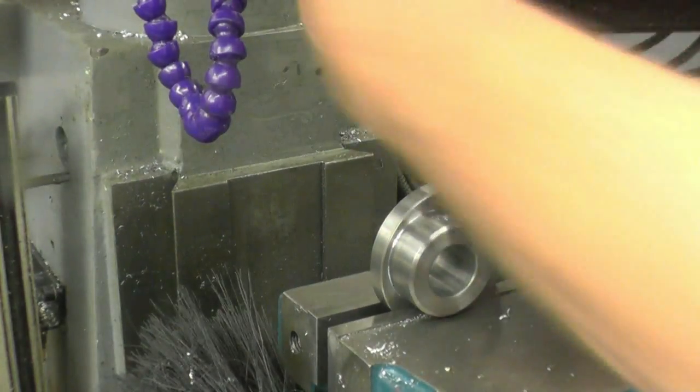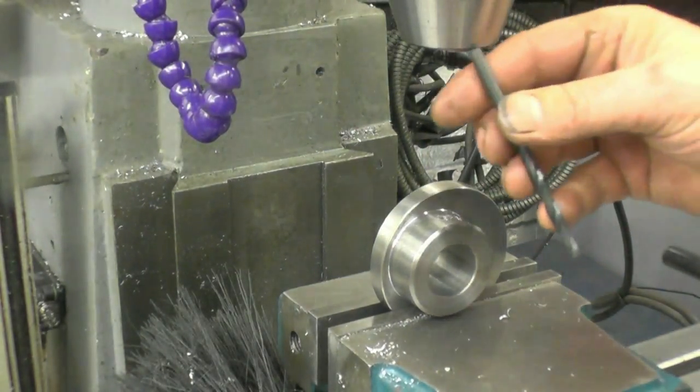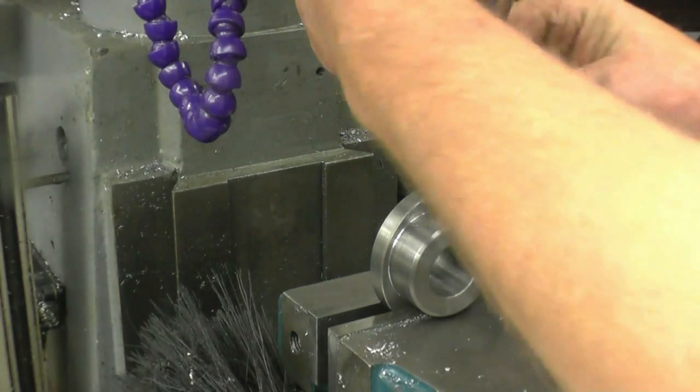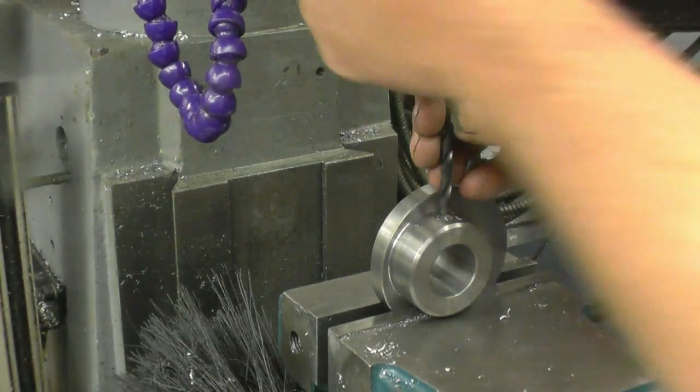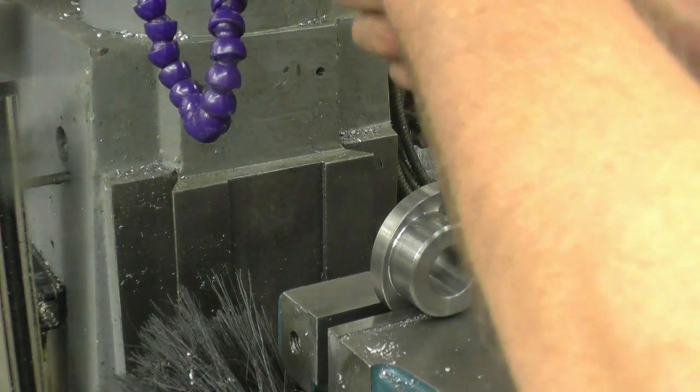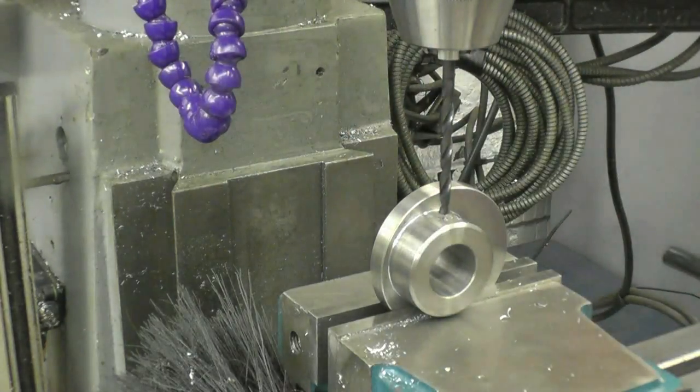Right, I've got a tapping chart and it says a tapping drill for quarter BSF is 5.3 mil, and the nearest I've got to that is a number 2 number drill, which is 5.35. I'm sure that'll do the job. It's not, it's a number 3 number drill. The first thing, I've used a variable speed drive on the milling machine. And I'm looking forward to using it actually.